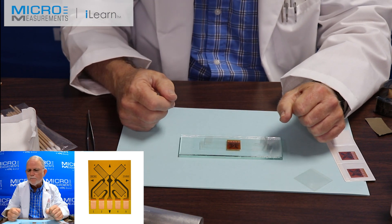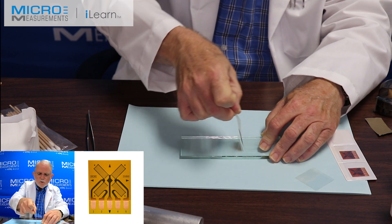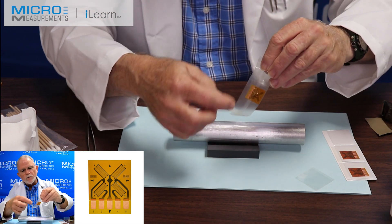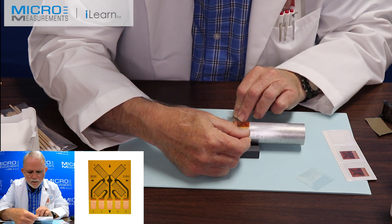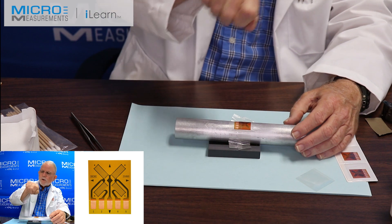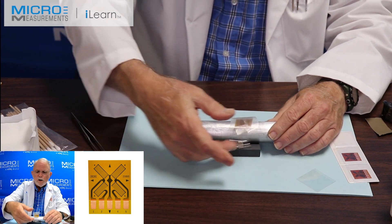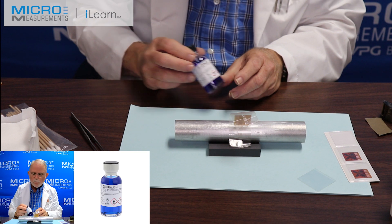This allows me to pick up the whole gauge in one piece. I'm going to lift at a shallow angle until I expose the bonding surface of the strain gauge, then pull it off the glass plate. Now I position my aluminum tube such that the alignment triangles — there's one here and here for the linear direction — are lined up on my alignment line. Notice as I put it around the tube there's no double curvature. If I had put it along the length, when I pulled it up it would have had double curvature, which would have been potentially damaging to the strain gauge.